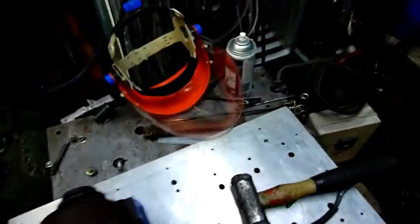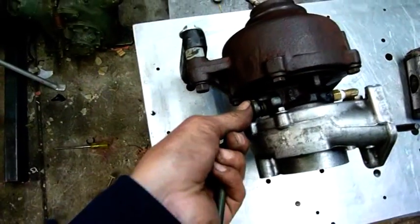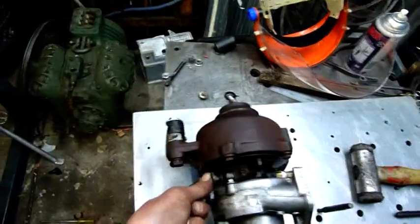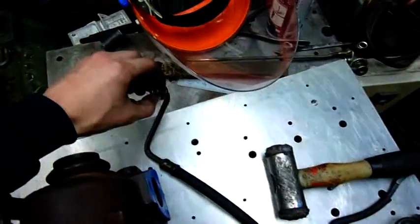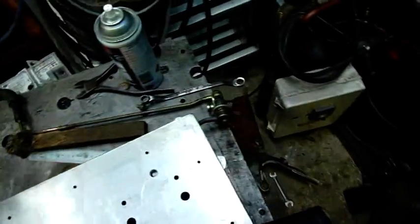I found these lines from the old Hyundai 1.8 litre engine — these are the fuel injection rail fittings — but unfortunately that one's too fat, it doesn't fit in the hole. The bolt pattern's perfect, but I can't use it as an oil return because it doesn't go in. That side does, but it's too small unfortunately. That one has a banjo bolt fitting and other stuff on it, so I might be able to use that.